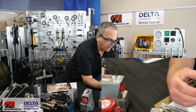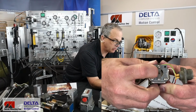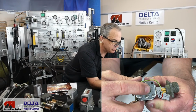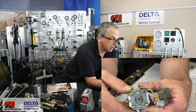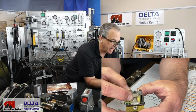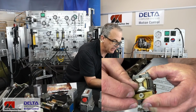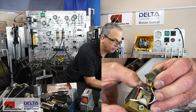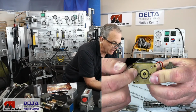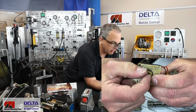And then here is that pilot stage torque motor. Yeah, those couple of very critical soft springs that are a part of recentering that T-shaped armature back into the center. They've gone missing there, but you'll see them in our three-dimensional views here in a moment, because these gaps here, when the valve is neutral, should be exactly even, these 4 gaps, 2 on one side, 2 on the other, and that should then be holding the flexure tube. That's a word for you, but that's part of the Moog literature for this type of valve.